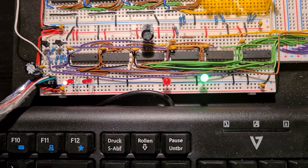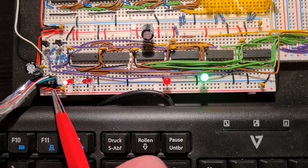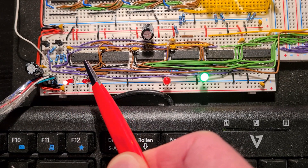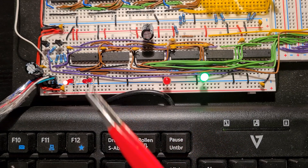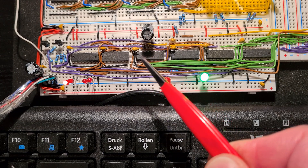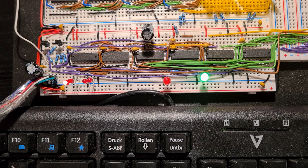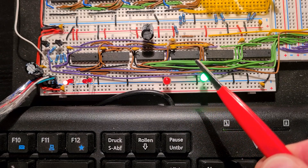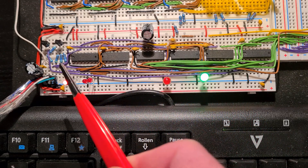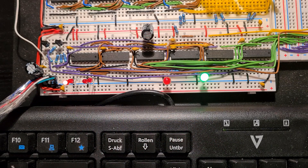The last device is a PS/2 keyboard controller that reads scan codes from the keyboard via a shift register, so that a scan code can be sent to the data bus. As soon as the scan code is available the clock of the keyboard is inhibited so no additional bytes will be sent. This logic can also be used to send bytes to the keyboard to adjust its LEDs.